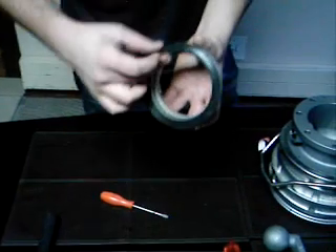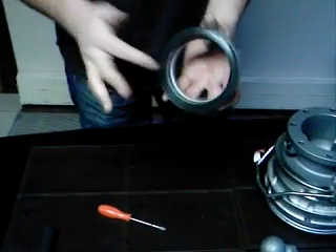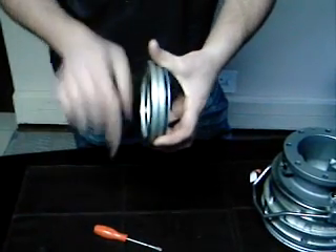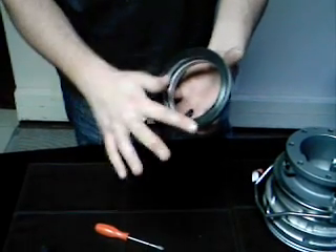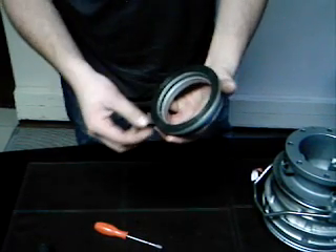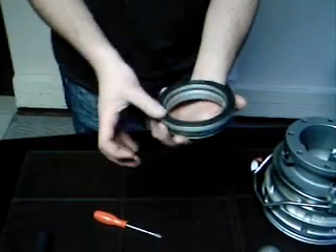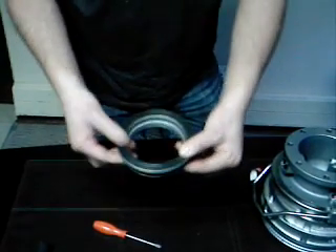After you've done all your O-rings, you'll see there's one seal on the front — this is called your face seal. Very important seal. When it's latched towards your adapter, it stops leaks coming down there, dripping onto the floor while the product is running through. So always replace your face seal — make sure there's no marks, no damages on it to keep a drip-free area. Easy, just pull it out here, put your screwdriver in, pull it out. Press back the same way in the four areas.